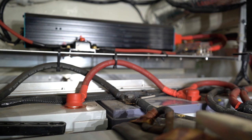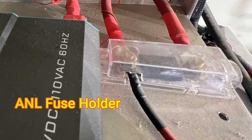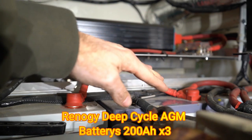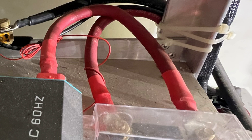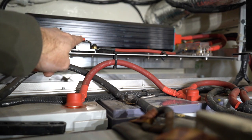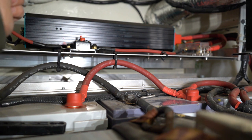Here it is all wrapped up. Starting over here: there is a fuse on the hot side of the battery bank down here before it enters my inverter up here. And I've tapped off the hot side of that fuse into a 50 amp circuit breaker here, and that gives me a 12 volt panel upstairs.